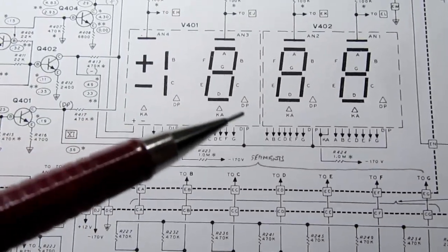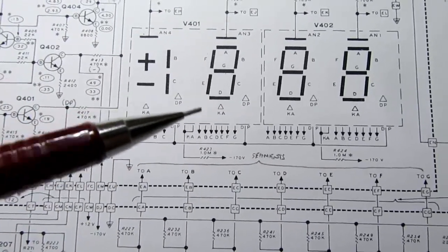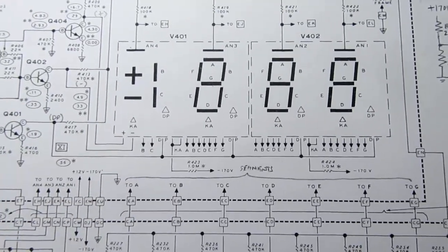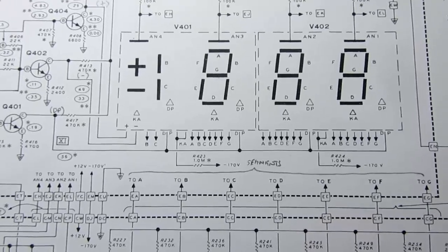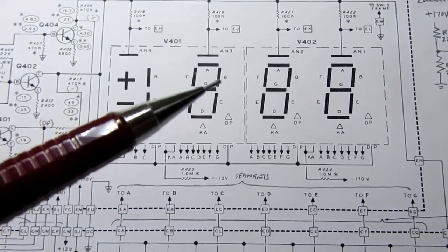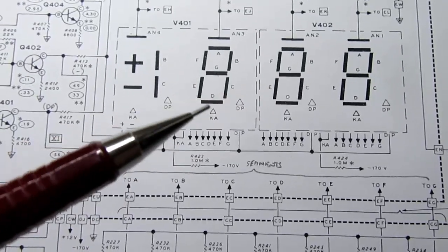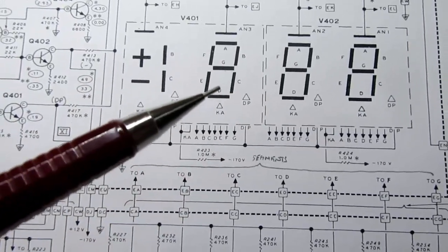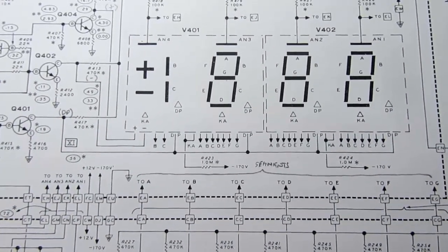And by disabling the latch function and letting the display constantly show the counter accumulator value, it looks like all the segments are on, but it's happening so fast that they're kind of dim. But then when the chip actually gets to the point where it's completed its count and actually wants to display something, then it's allowed to without all the flicker. So the end result is you get a minus sign that's forced on. All of the segments seem to be on sort of dimly, but the actual number of the battery test value is bolder, and you can actually read it, 5.20 or whatever. So that's another function. That is deliberate.